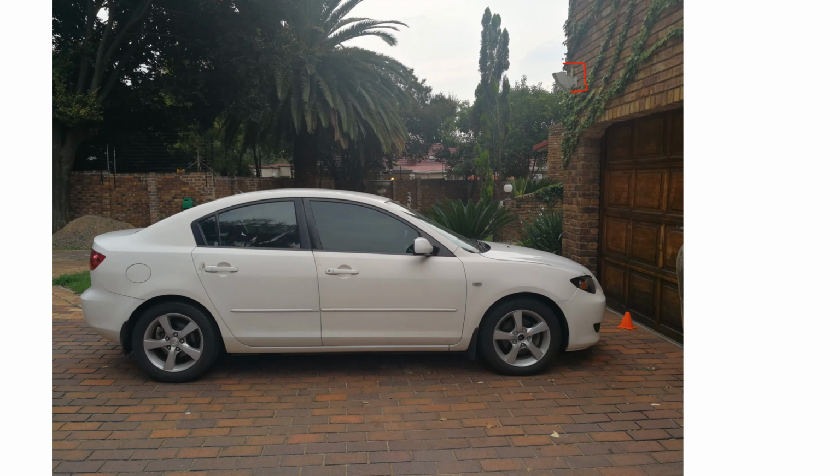Now, HX is the Optex range for the high mount, and it should be mounted at least 2.8 meters above the ground plane. As you can see, this is the ground plane. Yes, I know that is an obvious point I've just said, but I'm going to explain to you why this car parked here will create false alarms. Let's just work this out. This happens to be installed at 3 meters, which is fine. That is part of the specification.